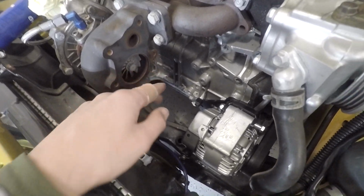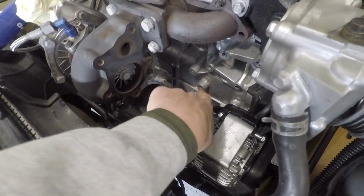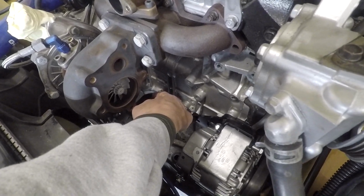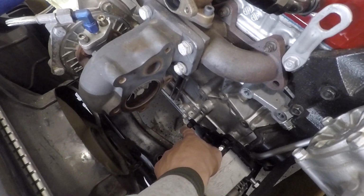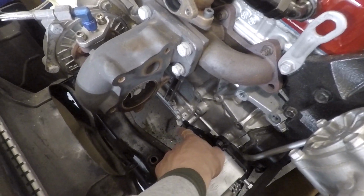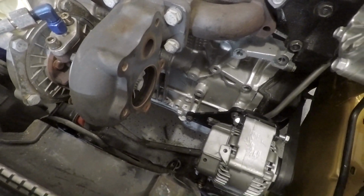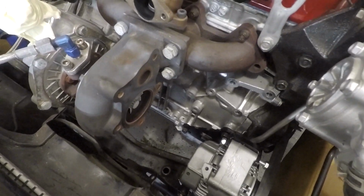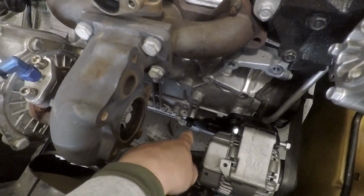So in order to make this bend, I have to come around this way back towards the motor and head over down that way, and that way I'll have room to route my oil drain around there, because it's in a bad spot on the pan. I had the motor out when I drilled the hole for the turbo drain, so I wasn't really planning the whole exhaust setup. I tried to find a good spot on the pan, but I forgot that it could be a bad spot here, and it's in the middle of everything. I wish I had put it further over to the right.